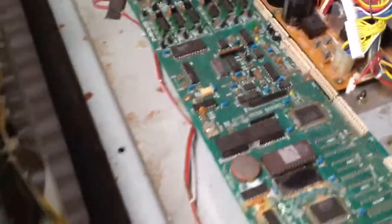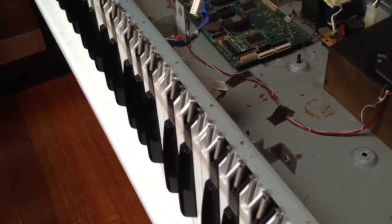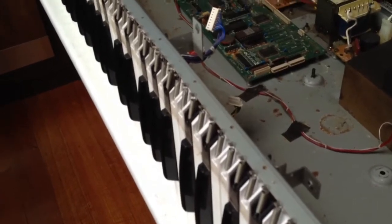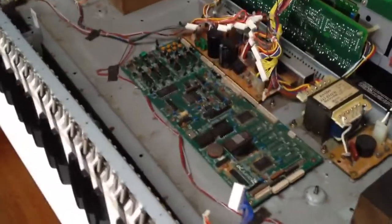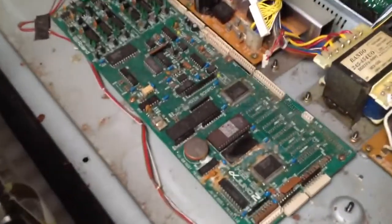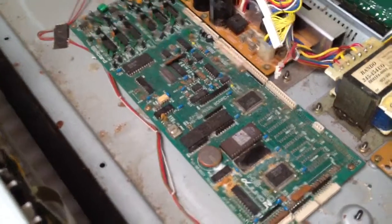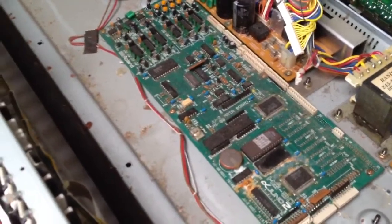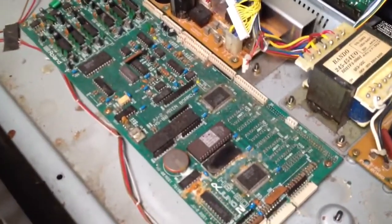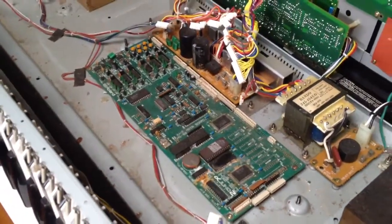In terms of the keyboard itself, I haven't really looked much more at that, but I would assume that the damage to both the keyboard and the board is probably due to liquid coming onto the keyboard. It seems to be rust more than corrosion. The battery has clearly leaked a bit, but looking for a common cause, the simplest answer is that one bad thing happened rather than two. A broken track on the keyboard PCB and that corrosion could well be from the same source. So I'm going to take that board out and have a closer look to see what I can do.